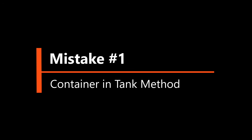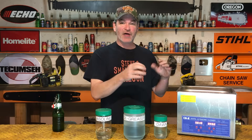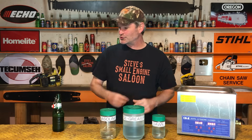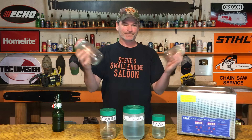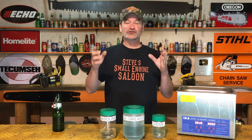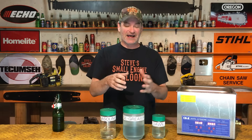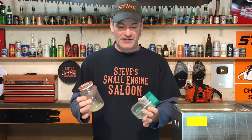Number one: use the container in the tank method. I fill my ultrasonic cleaner up to the fill line with nothing but water, and then I just use different jars. I use peanut butter containers because they're plastic. You can also use pickle jars — big or small. The problem with glass jars is I don't like to have glass around my shop. If I drop one on my concrete floor, glass is shattered everywhere. That ultrasonic sound wave will go through plastic and through glass. When I tested identical cleaning solutions in a plastic jar versus a glass jar, the glass jar definitely cleans faster.